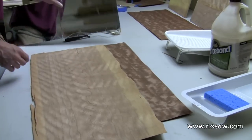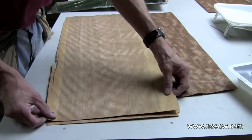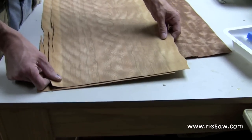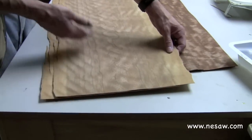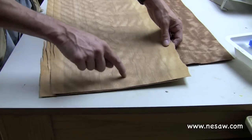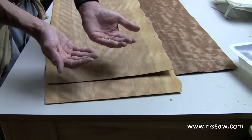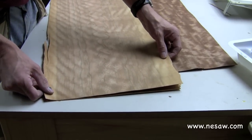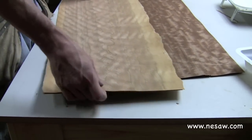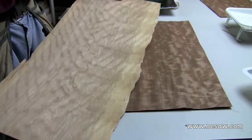Before we do any cutting, we need to stack these veneers up and line up the grain. You can imagine if this was shifted and I taped these together — because I'm going to cut through both of them at the same time, so I'm cutting through exactly the same point. If these weren't lined up, I would end up cutting one maybe here and the other one over here, and I really wouldn't have a true mirrored piece. So I have to line them up and tape them together before I make my cut. Since I want the exact same pattern on both panels, I'm actually going to stack up my four pieces and cut all four of them at once.